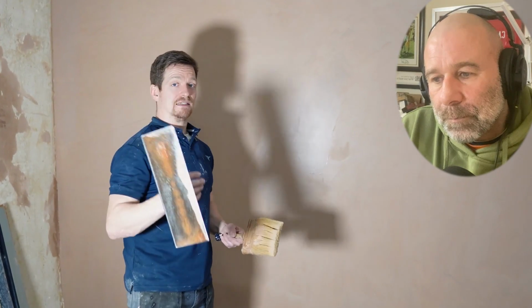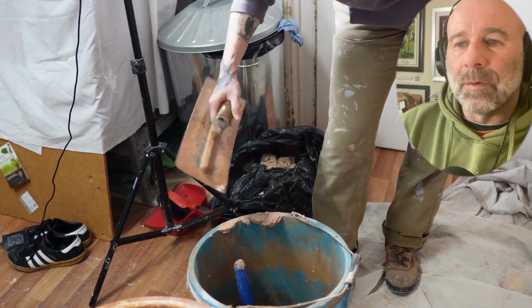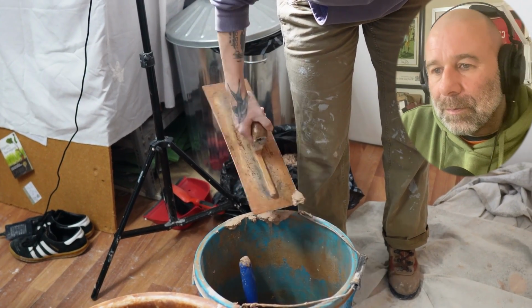But this is going to give you, Alex, a massive chance just to get better at that movement, because we just do the same thing. Plastering is very repetitive. We apply the plaster, do it twice, and then all we do is just flatten it until it looks good. The angle changes a bit further away from the wall this time, and that's just going to polish it. You're going to scrape it all off. So you're going to get a bit of excess.